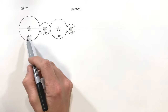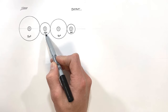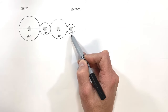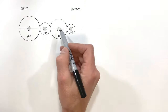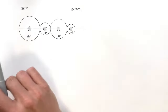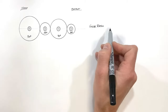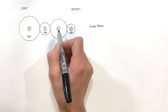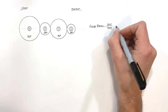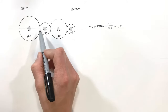What we have here is a simple gear train made up of a 50-tooth input gear connected to an input shaft, which is turning a 25-tooth idler gear, which is in turn turning a 40-tooth idler gear, and that 40-tooth idler gear is turning a 20-tooth gear connected to an output shaft. These two idler gears don't really serve any basic purpose for what we're dealing with here. When calculating gear ratio, we don't concern ourselves with the idler gears — we're only worried about the input and output gear teeth. So we have 20 teeth over 50 teeth, giving us a gear ratio for this entire gear train of 0.4.